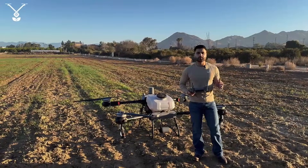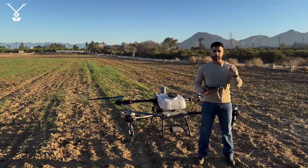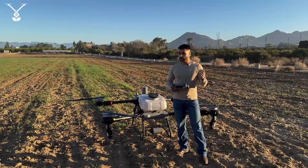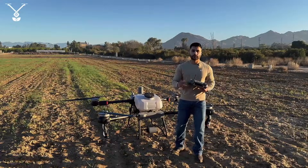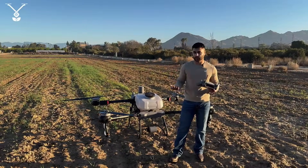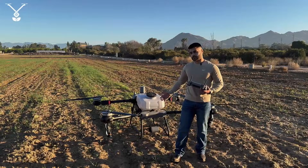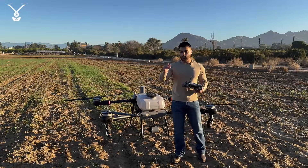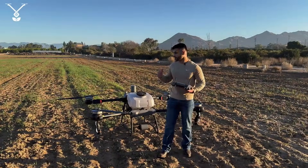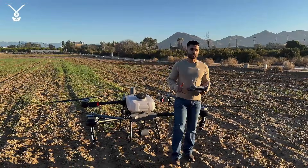On orchards, you may not reach that max speed because you need higher gallons per acre. But for corn fields, row crops, or vegetables — when you spray a lower amount like two gallons per acre for fungicide — you can go at max speed with the two-nozzle setup. If you want to spray a bit more and still go at max speed — roughly 30 miles per hour — you can add the 60-liter tank plus two additional nozzles on the drone. Thank you for watching.